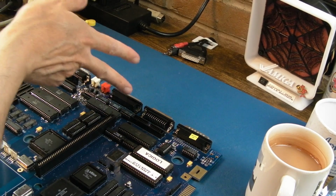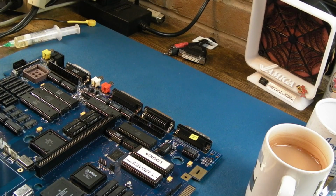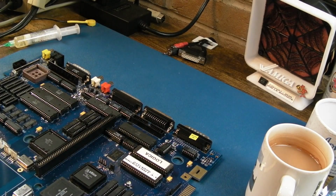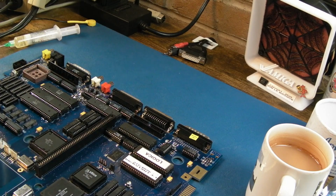The spurious interrupts might be from the port. It might be serial port detecting something, I don't know. Because you would assume it's probably interrupt driven, like 1 or 2 of the pins on it, so that the serial port can respond to things. And if you've got floating connections there, because you don't have chips, then yeah, it's possible we could have had spurious interrupts that way, maybe.